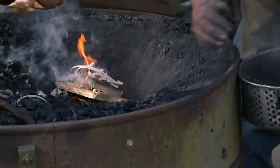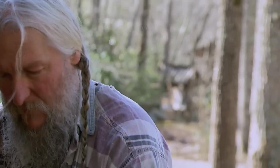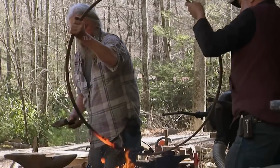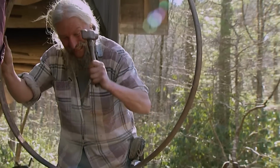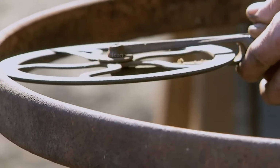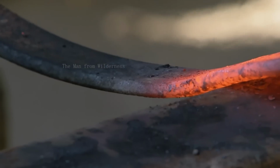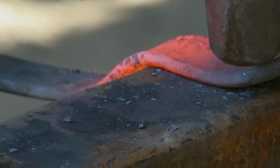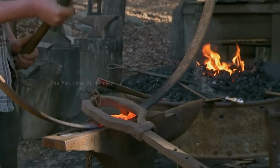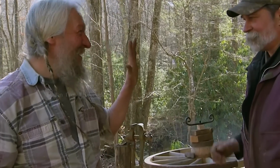They decided to modify it by heating the rim in a furnace. High temperatures alter the molecular structure, making the iron more elastic. Eustace began hammering to elongate its circumference, but ended up extending it too much. They had to heat it again to slightly shrink it back. Using a device called a shrinker, they placed the deformed iron rim between two clamps and hammered continuously. The shrinker tightens the twists in the metal and holds the folds together. After measuring the diameter again, Eustace found it to be just right.